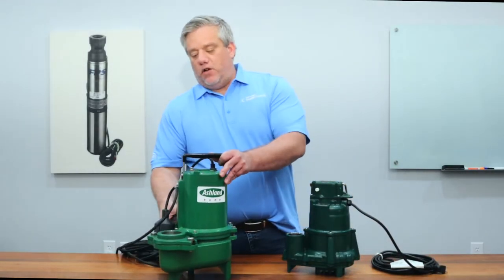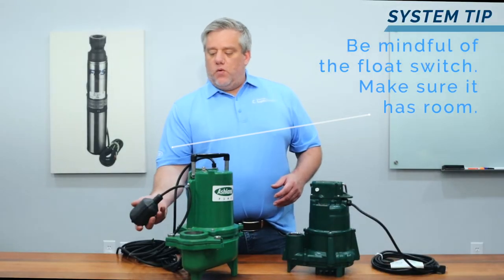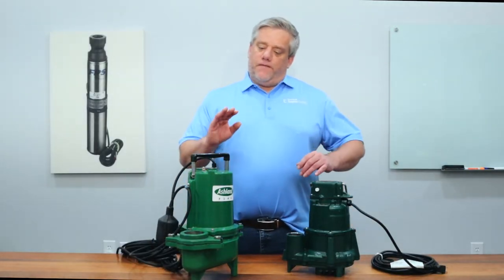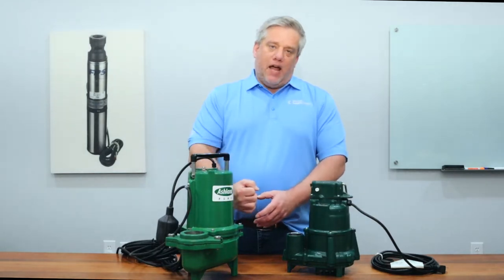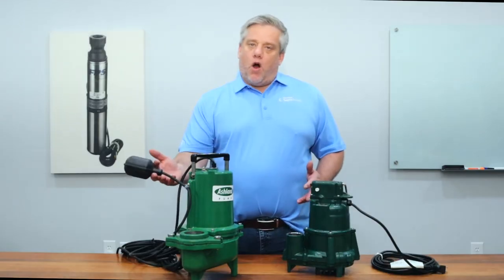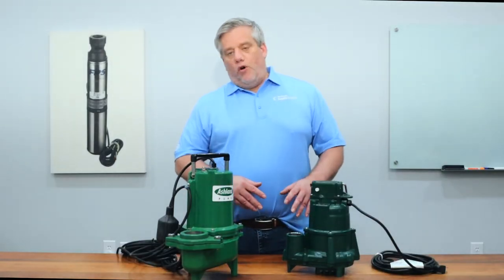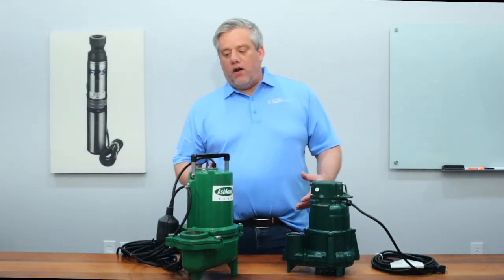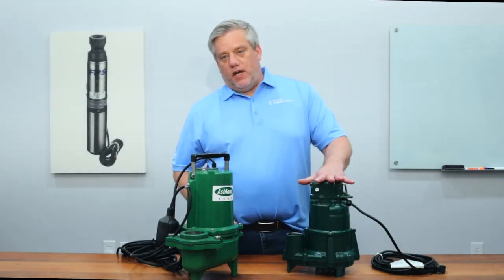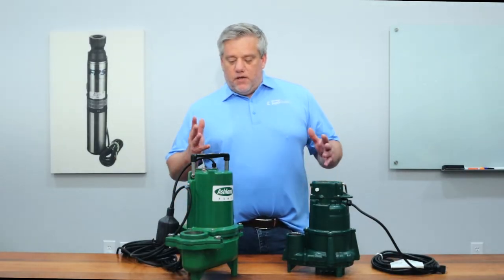This is a half horsepower pump with a float switch attached to the side. Be mindful when installing in your tank that the float doesn't hit or get hung up on the wall — it's a wide angle float, so it has to come up wide before it turns off. Some pumps come with a float switch attached to a bar that goes up and down. The issue with that design is if the float switch goes bad and it's built into the pump, the whole pump is junk and you can't just switch out the float. So we like the separate float switch arrangement better — it gives you more flexibility.